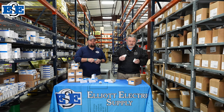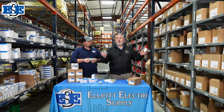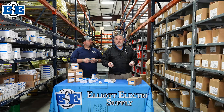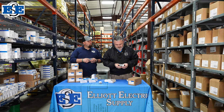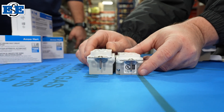Thank you, Nathan. Like you said, Eaton's come out with the new line of Slimline GFIs. Our old version, while a staple in the marketplace and a successful product for many years, we felt needed an update. The first thing is this device is much slimmer, giving the installer much more room in the box. As you can see here, there's a full quarter inch taken off the new product against the old product.